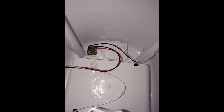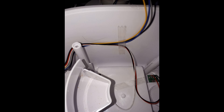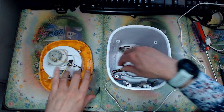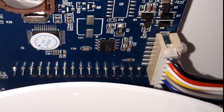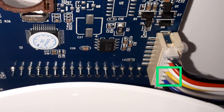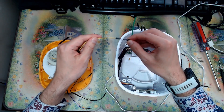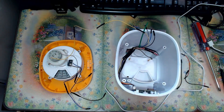Inside, wires are soldered to terminals and there is what looks like a JST header connected to the main board. There is a white wire from the battery to the board, and pairs of wires going to the motor and to the lever switch. The motor's rotating structure has corners that press the switch three times per complete spin. I cut all the wires at about midpoint, leaving me with a disconnected main board, red voltage and black ground wires, yellow positive and gray negative wires for the motor, black ground for the switch's input, and a blue wire for the returning signal. I finished all the cut wire ends with Dupont connectors so I can easily rewire the feeder back to its original state.